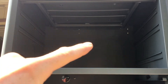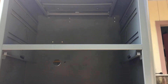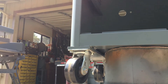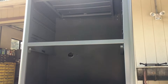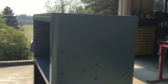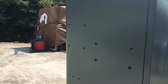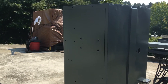You can see the square tubing that's been added — that really ties the room together. On the bottom there are also big chunks of plate that span across, and that's actually what the casters are bolted to. The plate is tapped. There's also a panel that's been bonded and riveted onto the side of the enclosure, with nutserts for things that mount there — that's where the intensifier, regulators, and oil pump bolt on.